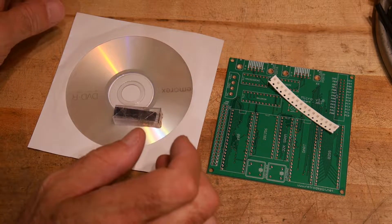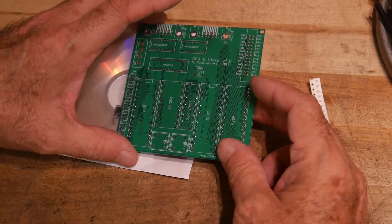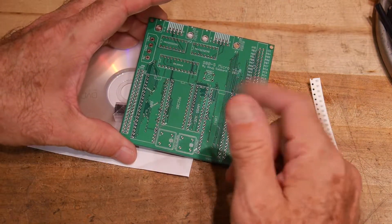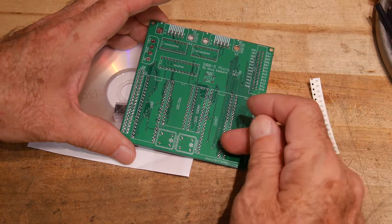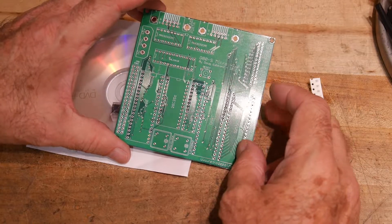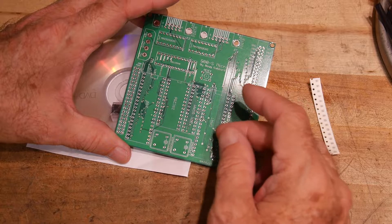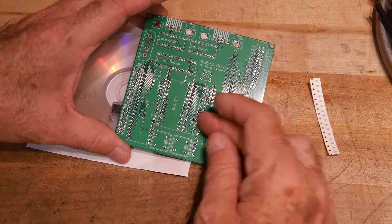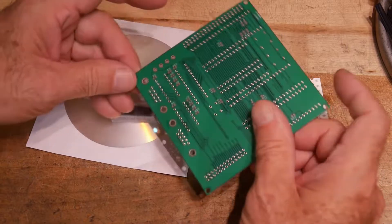Like I said, it doesn't do much. When you get it actually working it just boots up a monitor program and you can peek and poke around, do some memory dumps and things like that. I think there is an Intel hex loader so if you develop a program you can load it via the serial port. And I believe there's a version of TinyBasic that'll run on this board, though I don't know if you can make it run locally from ROM or if you have to hex load it every time.